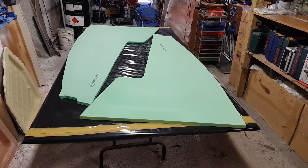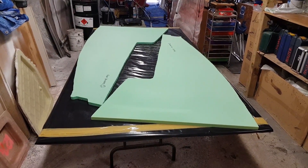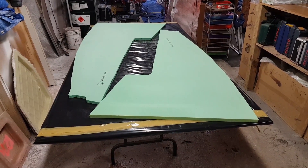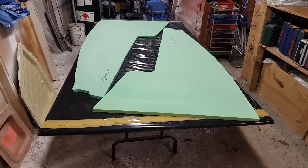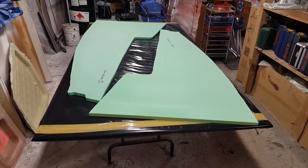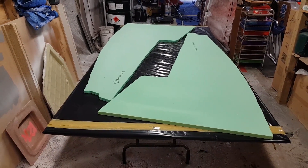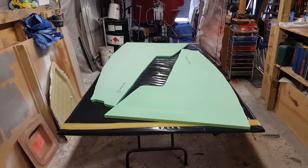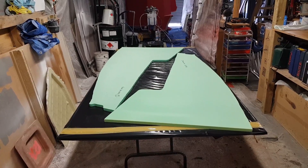So that's around about 1800 grams per square metre - a fairly substantial layup, but it will save a lot of weight. A piece of plywood of that size, you're starting to get up there with weight. I'm happy to go with foam - no rotting, no issues going forward. Being able to lay up two at once is just absolutely superb. I'll just keep going and then this afternoon I'll flip them back over and get the second layer on.